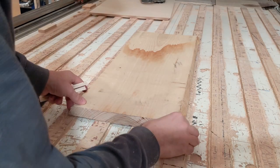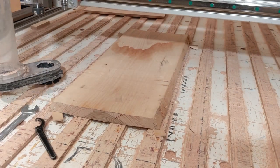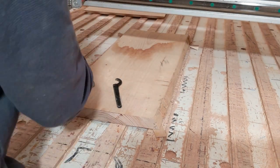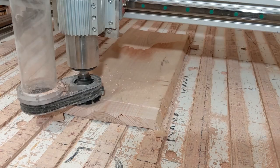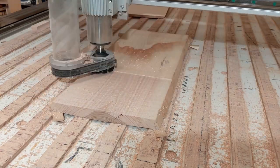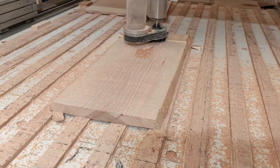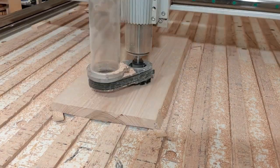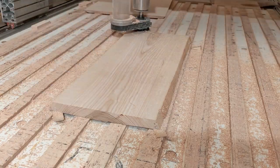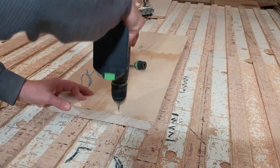To begin with, the first thing I do on this project is to plane the bottom of the piece of ash wood that I'm using. I do that at 90 degrees — across the grain. I found this works best because the wood chips better this way. If I route it parallel to the grain, you get these long splinters which clog up the dust extraction. That can be a real pain, so I prefer routing across the grain. It works better.